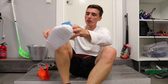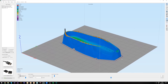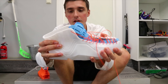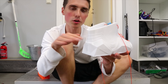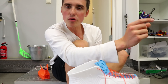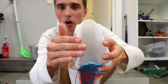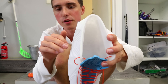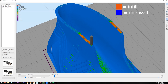They are quite interestingly built. If you look at how the printer makes something like this, you have a whole lot of settings you can adjust — one of which being how thick you wish this portion to be. The more material you have, the more stiff the shoe is going to be, so you really want to balance flexibility, toughness, and layer adhesion. This shoe was built out of almost 800 layers, and every single stream of extruded material is only 0.4 millimeters wide.